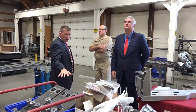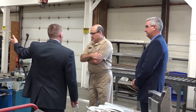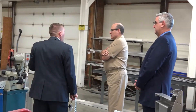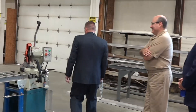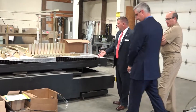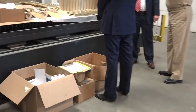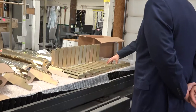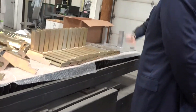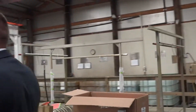Once things get done with fab, aluminum products or whatever, they take the conversion coating or MIL-C-5541 so they don't oxidize. This gives you an example of all the parts we're running through right now. This is bare aluminum stock, and this is what it looks like after we iridite it or apply conversion coating — it gives the gold color to prevent oxidation before we send it over to paint or final coating. Everything goes with a traveler so we know and can distinguish each part along with the drawing so everything can be kept in order.